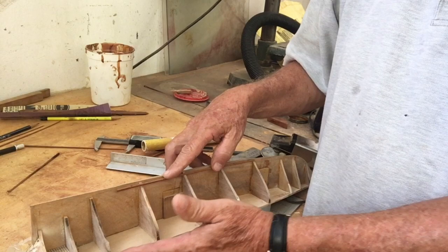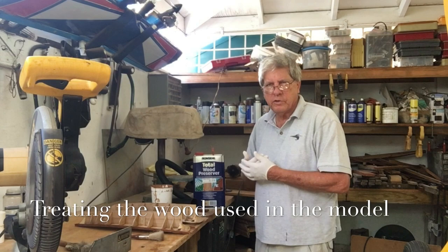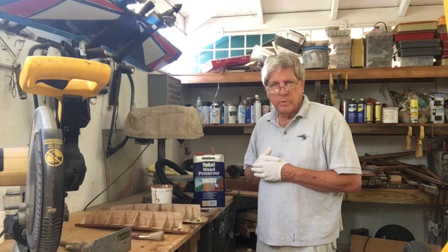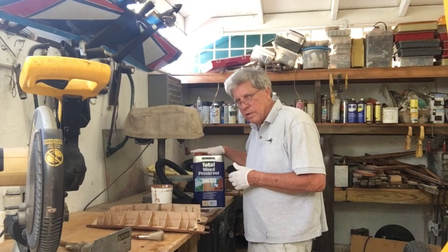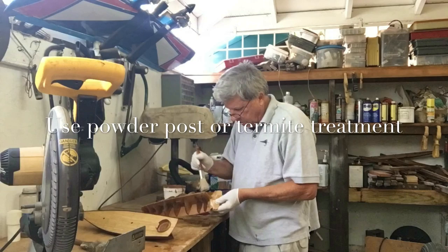If you live in a tropical climate, then all wooden products that are untreated are subject to powder post beetle, which this kit was originally subjected to, or more importantly, dry wood termites. It's impossible to know whether the powder post beetle came from Africa with the wood that was supplied with this kit, or somehow got into the kit while being stored at my home. Key is that you don't want to spend hundreds of hours working on a model only to have it destroyed by the insects. So you need to treat it with something. I'm not going to recommend any particular brand of termite treatment. It'll be specific to where you live and how easy it is to apply, but it should be white spirit based.